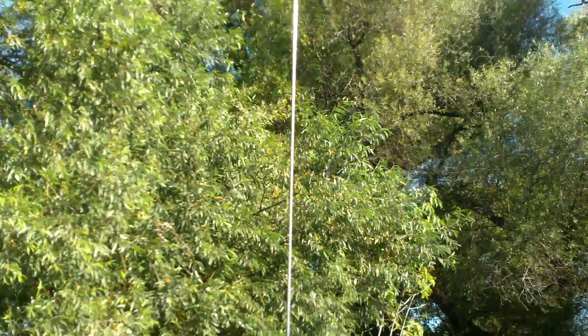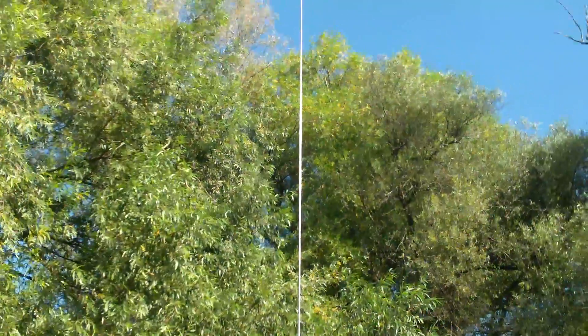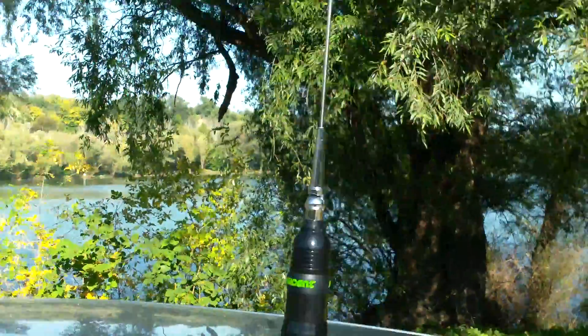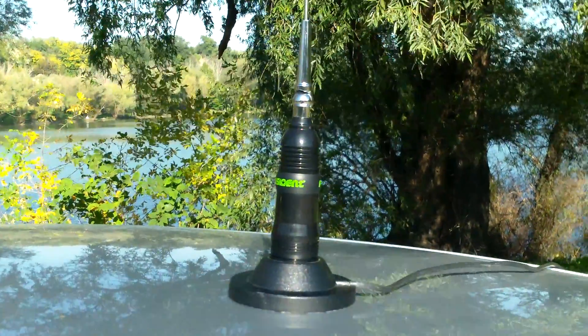This one is okay from about 26.4 to the top end of 27, 27.900. Then it gets a bit unhappy. If you have a radio with an ATU, just give it a prod and obviously the SWR is down in an instant. Bit of a compromise.